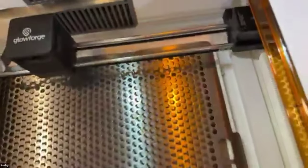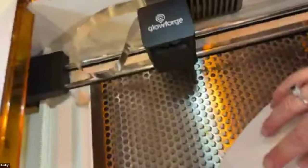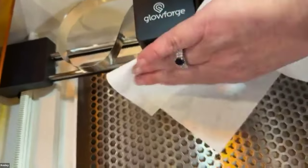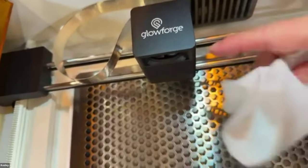The other thing you might want to clean every now and then is the printer head. To clean it out, I use a little eye cloth with a little alcohol. As you can see in there, there's a little lens inside and I don't clean that off, but I clean around the outside of it because you get a lot of stuff burning and little pieces fleck off. You also want to clean off your lens — take your alcohol on your lint-free cloth and just clean off that lens.